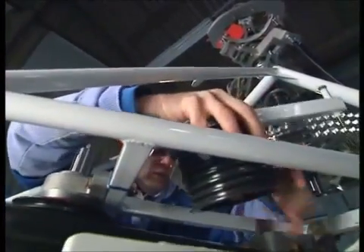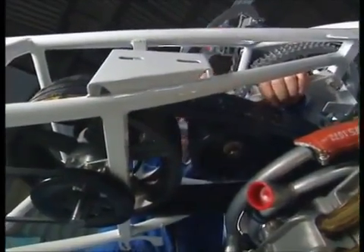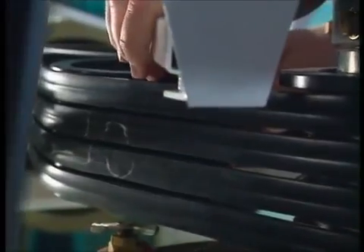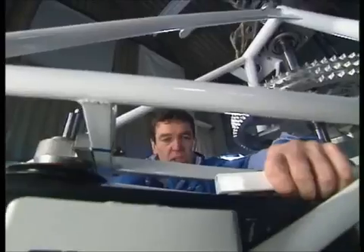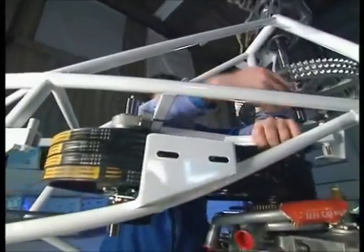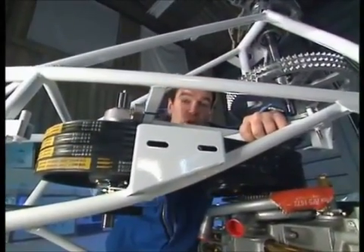This is the main workings of the clutch, which there's quite a lot of assembly work to do on. It's bracketry, but it will fit in here something like that. When the clutch is engaged, this arm will move this big pulley here out sideways like so, which will tension the belts. That's controlled with a rod lever that goes through into the cockpit, so it's a bit of a bench job. Please take a long hard look at this plan, and when you've worked out what it's all about, could you let me know?